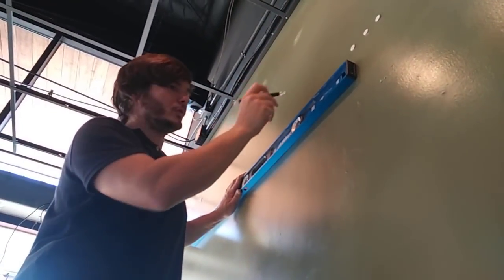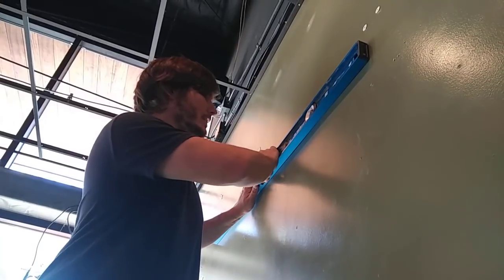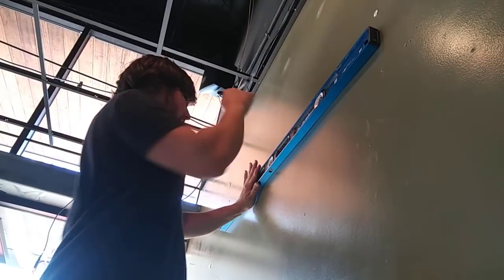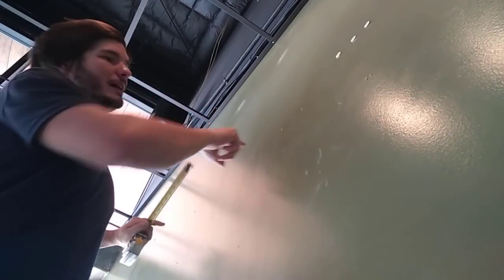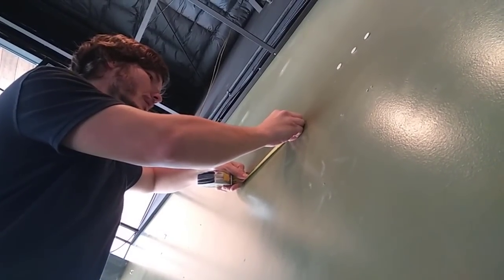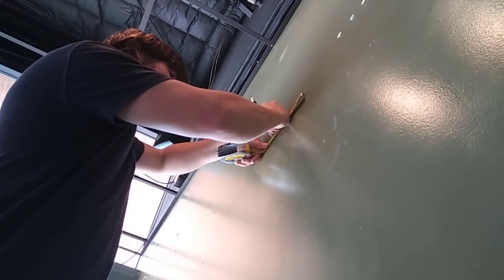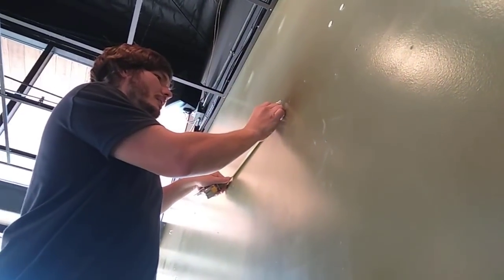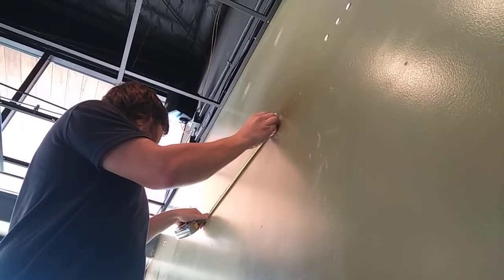I know that I need about five inches in between each mark, so I'm just going to estimate and put a line about this big — it's all going to be covered anyway. Then I know it's going to be about 20 inches, so I'll estimate over here and do a big line. Now I know I've got level. I need five inches between my monkey hooks, so I'll put that mark on there, then take a mark five inches over. Between the monkey hooks I've got about three-quarters of an inch, so I'll make that mark.